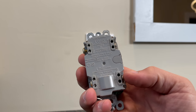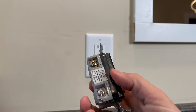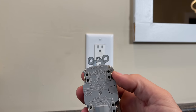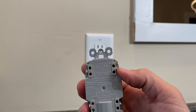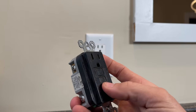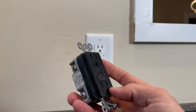This would be providing power to this 15-amp GFCI outlet. The load terminals — if this was a brand new GFCI, you'd probably have yellow tape over them. That tape would be removed if you have wires going to other downstream outlets that are not GFCI — just standard outlets — but you want GFCI protection.